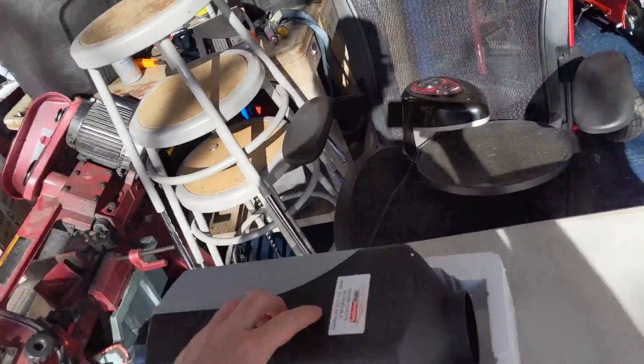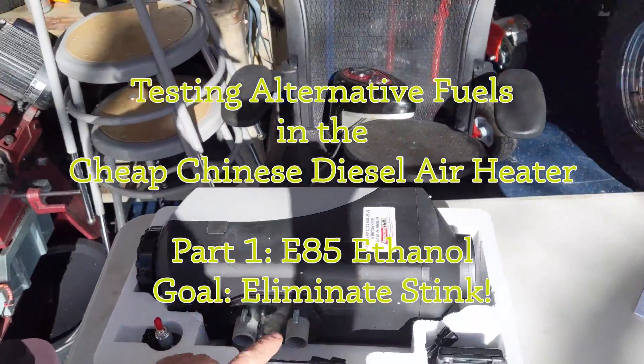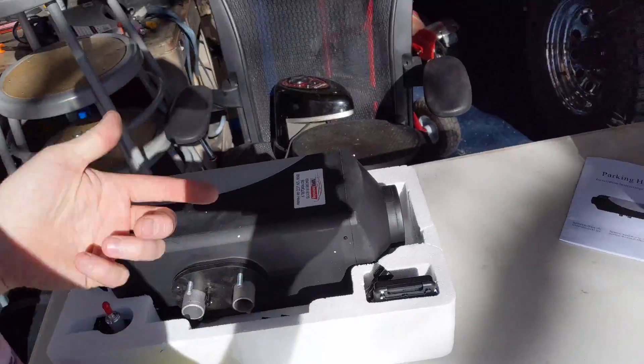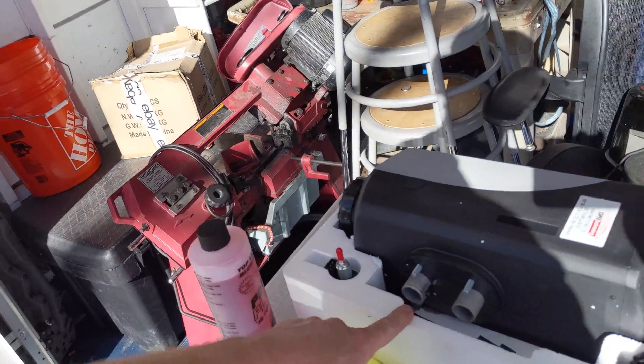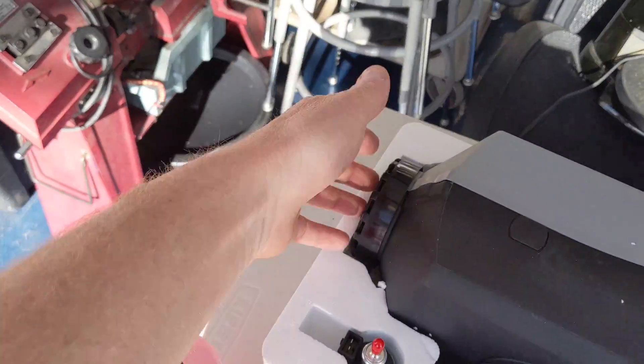I got one of these 8-kilowatt parking heaters. These are new Chinese heaters that are exploding all over the market. They have a little tiny chamber where it burns diesel fuel, with a small fan to keep airflow moving. Exhaust intake and exhaust go through one side, and hot air comes out the other side — this is where your fresh air intake is, so they're safe to use in vehicles and shops.